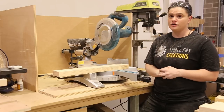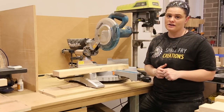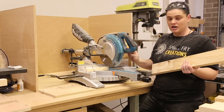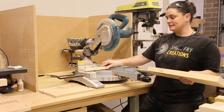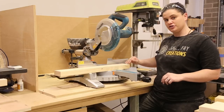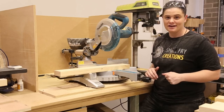To do this I'm going to use the miter saw. You could use the table saw, but given the length of my pieces and the fact that I don't have a crosscut sled yet, I'm going to do it on the miter saw because I think it is safer. Most miter saws have a depth stop, which I've set to half the thickness of my timber. I've also put a piece of timber up against my fence to bring out my 2x4, which means when I'm cutting my half lap I'll get a flat bottom across the joint for an easier cleanup.